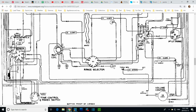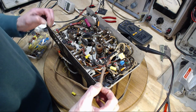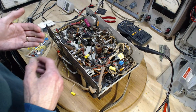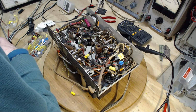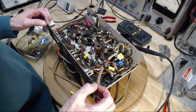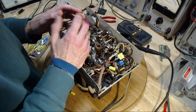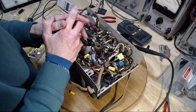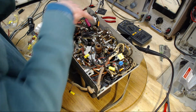Okay, let's look at the radio and see if we can figure out what this is. What is this? Okay, so that thing would be down in here. Wouldn't it be down in there? Should be between the switch. Here's the switch. And the terminal should be in here. Well, I don't see anything in there except a capacitor that's not on the schematic. I don't have a lot of options here. I think I better just replicate what's in here already and replace that capacitor down here.